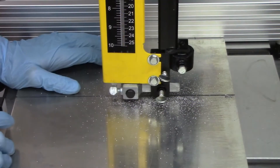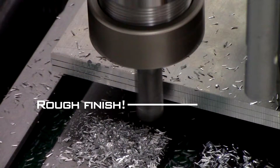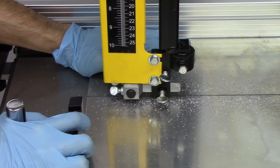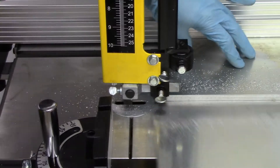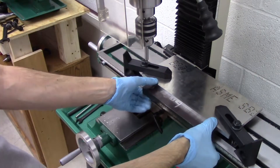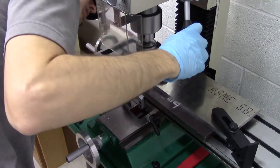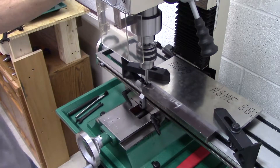Even though we were taking really shallow passes, probably about five thousandths or less per pass, we were still getting a rough cut. With conventional milling machines — that is, milling machines that are not CNC — you should try to feed the work in the opposite direction that the end mill is spinning. Think about a car driving down the road where the tires rotate with the ground plane. If you feed your work the same way, you might get some chatter which can cause a rough finish. That depends on RPMs, feed rates, and the type of end mill you're using, but generally it's better to run the end mill in the opposite direction you're feeding the work — like a car moving forward but the tires going in reverse. I know there's a term for this type of milling but I can't think of it at the moment — maybe somebody can comment with the correct term.